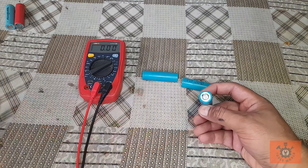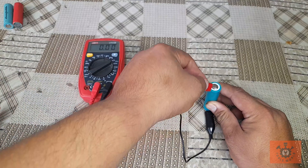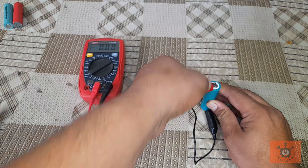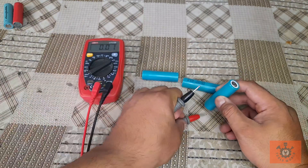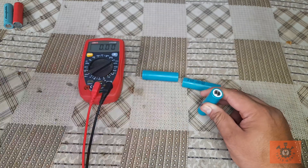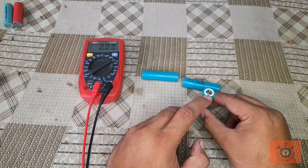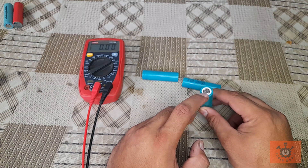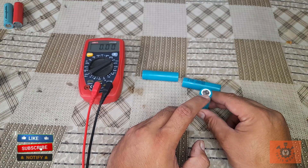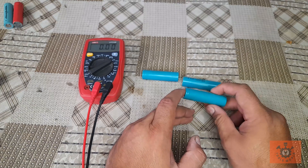To prove this, if you give them a parallel charge, they won't take any charge. Look — if you are giving them a parallel charge they won't show any kind of charge. The reason behind that is the circuit is detached from inside, which happened due to overcharging of these cells. There is a safety feature which lies inside the positive terminal which helps them to disconnect in order to prevent fire.